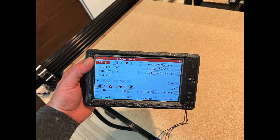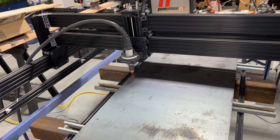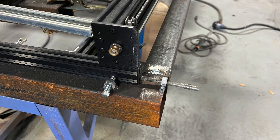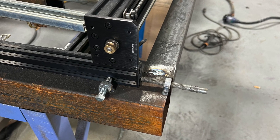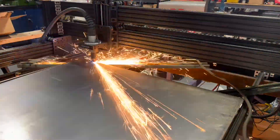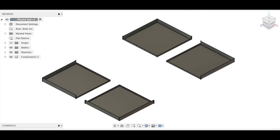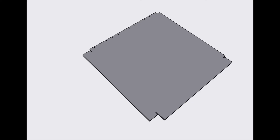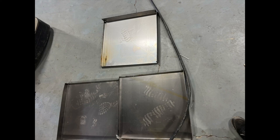I now have the machine set up in my shop on a 4x8 steel table. I had to cut the legs to lower the height and added some steel to accommodate the drag chain on the Y axis. I also welded 3/8 nuts to each of the corners to dial in the machine once I have the water table completed. Here are some photos of the design I created in sheet metal on Fusion 360. Please subscribe for future videos and comment with any questions regarding this build. Thank you for joining us at Work and Play USA.